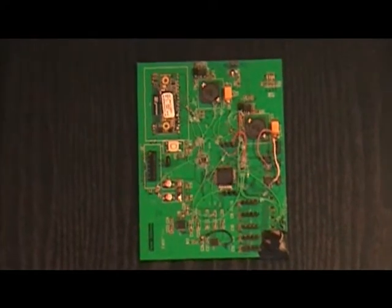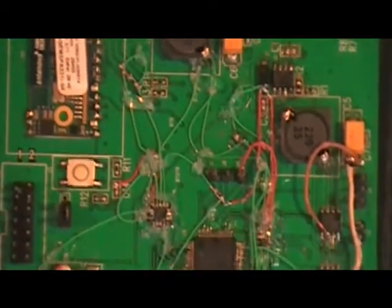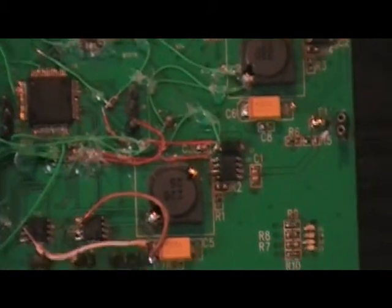In addition to collision detection, we also have onboard accelerometers and gyroscopes that help implement a navigation system capable of tracking position. One of the main changes in our navigation system throughout the development process has been to shift away from using pure dead reckoning as our primary navigation source to using a combination of gyro positioning data and real-time propeller speed. Due to the relatively low acceleration of the blimp, as well as its tendency to tilt and wobble,